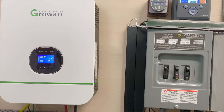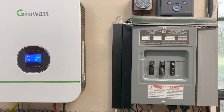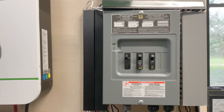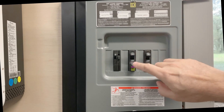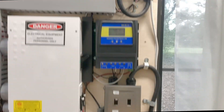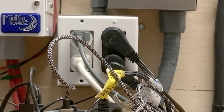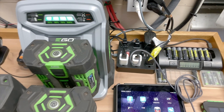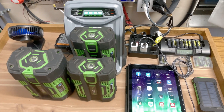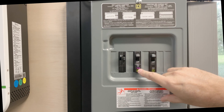The inverter turns the DC power from the battery into pure sine wave 120 volt AC. The AC comes out and goes into this breaker box. The first breaker goes to GFCI outlets running computers, hard drives, internet, battery chargers for phones and iPads, power tools, and yard tools — all right here in the office.